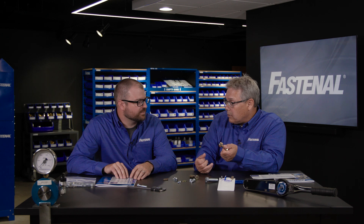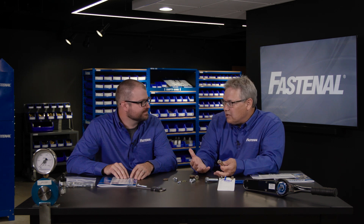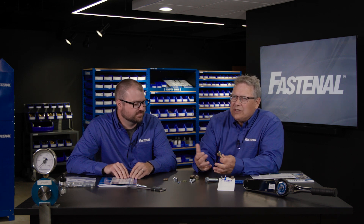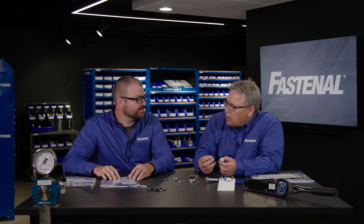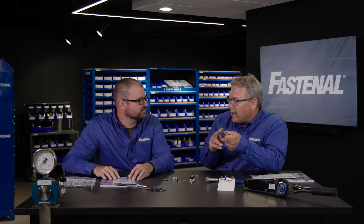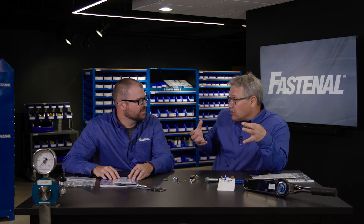We're essentially hugging the thread. A nylon insert lock nut versus a top lock nut is essentially the same thing performance-wise. "Prevailing torque" means the amount of effort or torque required to spin the nut on once that hugging mechanism has been engaged. Before we even start clamping anything, it's really just the friction between the piece of nylon and the threads — a friction resistance that will also keep it from loosening. That's the goal, in theory.